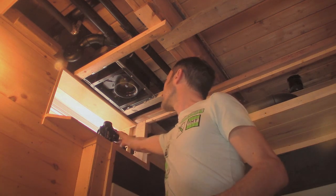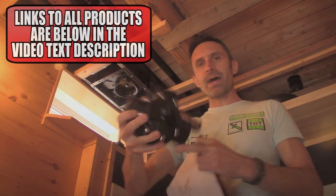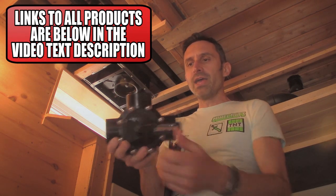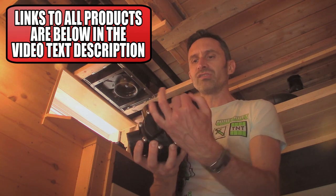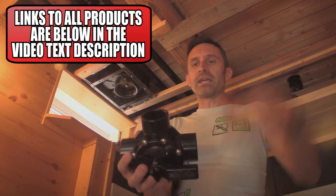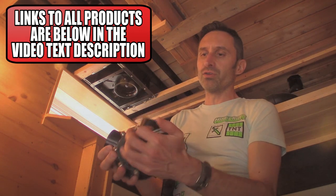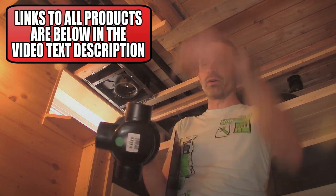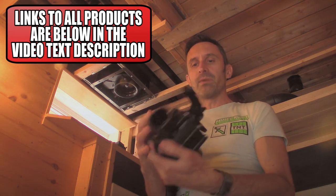The modifications I'm going to be doing involve these Jandy valves. I've used these in the past. What they are is a switching valve where you have this little handle and you can switch from one direction to another. It can either come in and be sent to the left or the right, or you can set them up so it can come from one end and either go to the left or keep going straight. You get some different options on them.